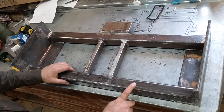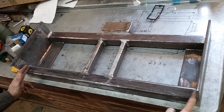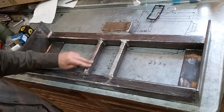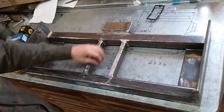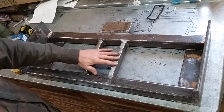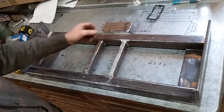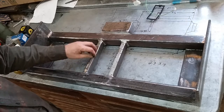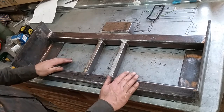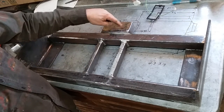This thing's built heavy — I didn't even weigh it. This is two-by-two quarter-wall tubing, 32 inches long. This through here is three-quarters thick. This is actually two pieces of three-eighths — because I can't read a tape measure — so there's two pieces of three-eighths by inch-and-a-half through here, all welded up good. This pad here is where the column will mount — this is one-inch-thick steel.